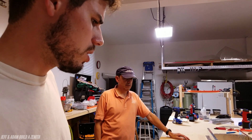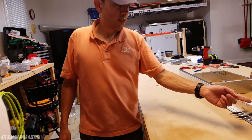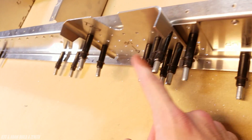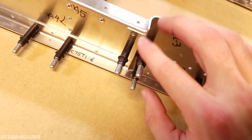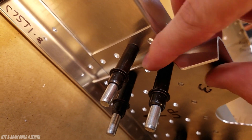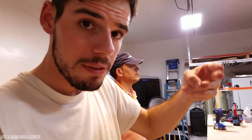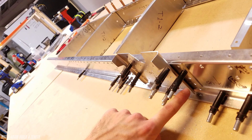I think we need to do our end caps. Do you want to talk about how we have to cut this piece? So this piece here was kind of hard to cut — we still haven't riveted it or anything, just clipped it in place. What seemed to work pretty well was to cut little sections — like relief cuts — along the section I needed to cut out, instead of trying to do one big long cut. I basically just did perpendicular relief cuts, and that seemed to help.